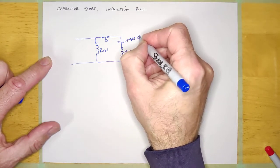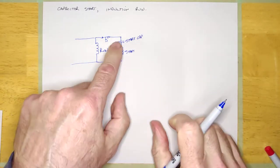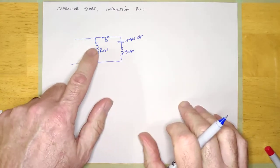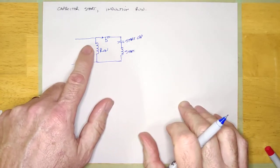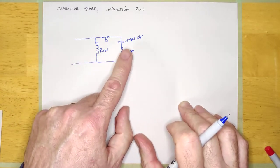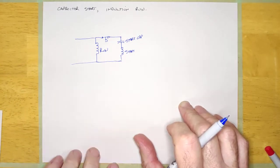There's the run winding — looks very similar to the last one, the only difference is this capacitor. With the previous motor, we had the run winding, which is a big inductor and lags quite a bit, and then the start winding, which is also an inductor and lags but not as much, so we had that 30 to 50 degree phase angle.